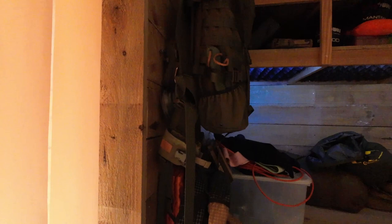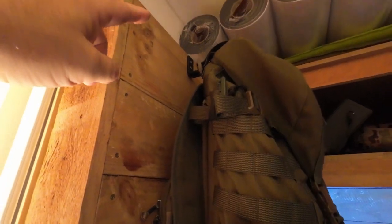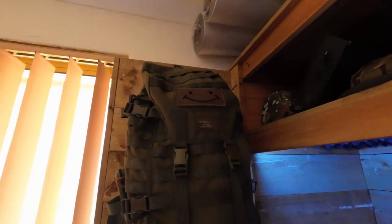Especially now, another thing I've done is this here. My pack holder. And it's big enough to hold three full size packs. And what I've got in the back of this is structural 70mm by 35mm pine. I've got five points where it's anchored to the wall, with one at the top there where the hook is, and then another support in here, another one where the hook is, another support, and another one where the hook is, just to make it all sturdy, secure, and that means I can actually hold all three packs on there, loaded and ready to go if need be.